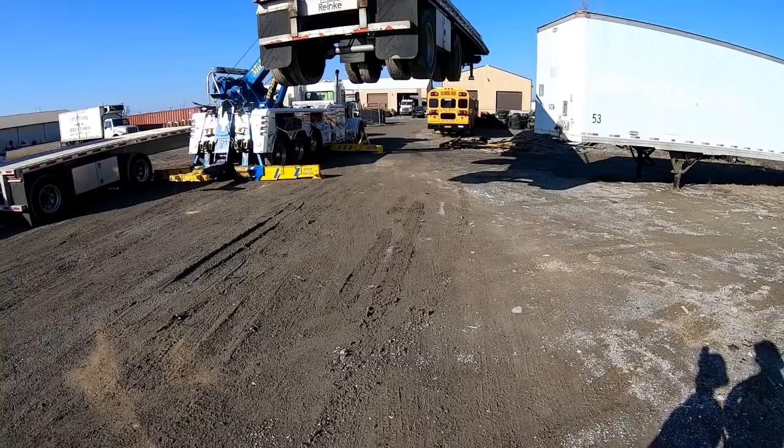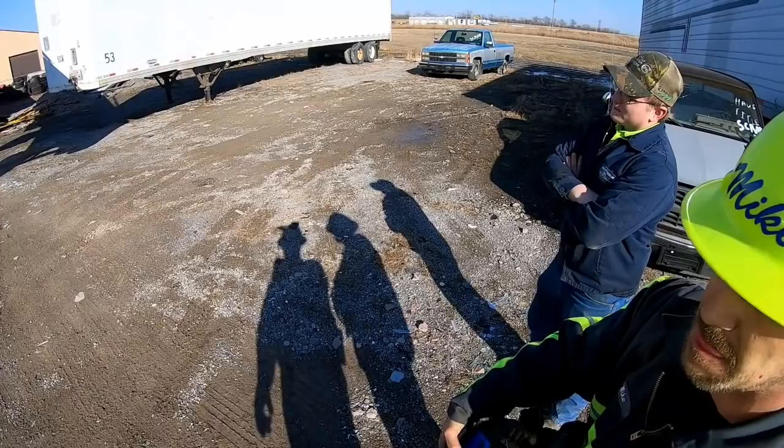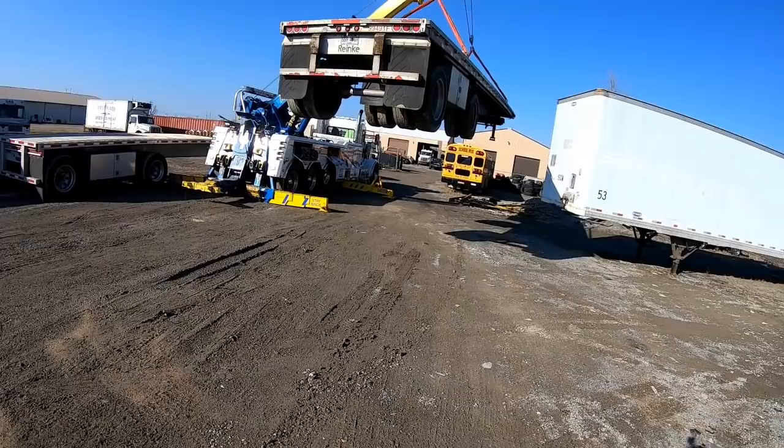Now, over your back corner, if you had a heavy load, especially with the boom rolled all the way back, is your worst possible pick location. That's your weakest link, right off of this rear corner or the other rear corner. Mm-hmm. That's your rollover, your tip point, that is your weakest point off the back corners.